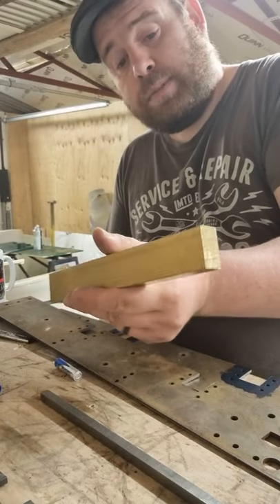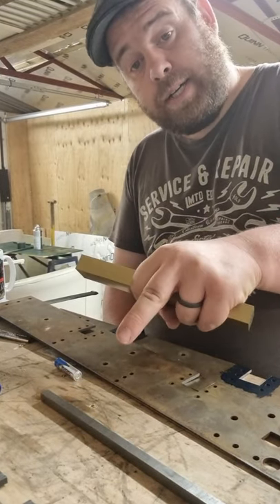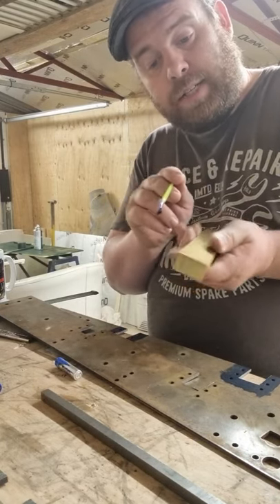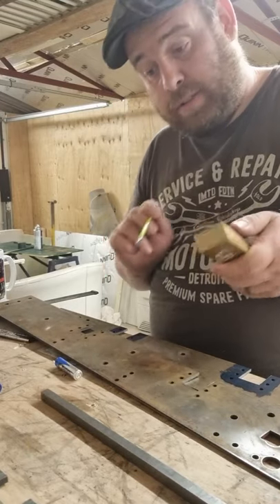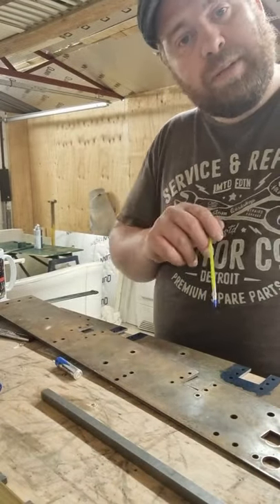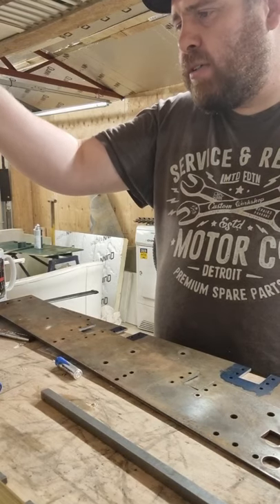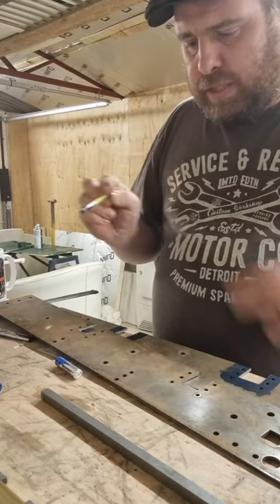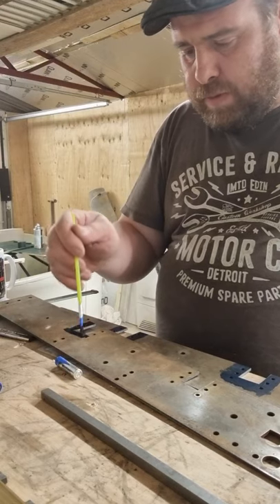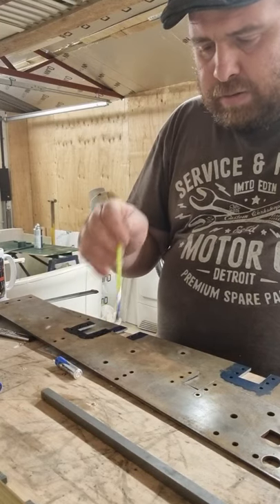I've had it in my car quite a while, so I've not actually got around to doing the actual boxes. But I need to mark out these so I can cut my bar to find the horn plates, then I can work out what slot I need either side and also what width the slot needs to be. At the moment I'm just bluing these up so I can mark them out. This is engineers blue, or layout fluid as some people call it — I call it engineers blue — and it just makes marking out a whole lot easier.